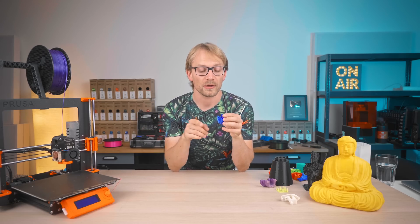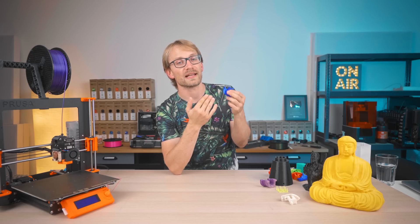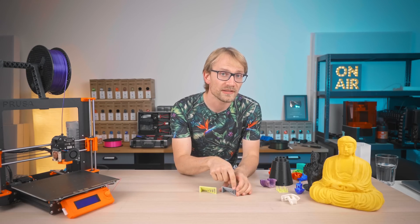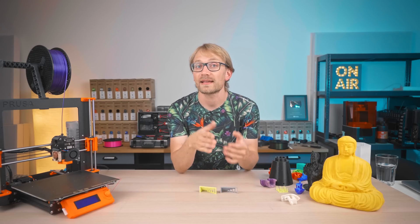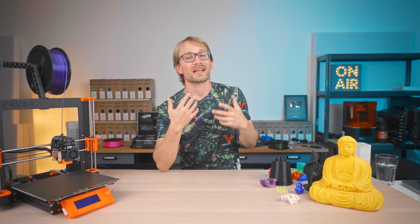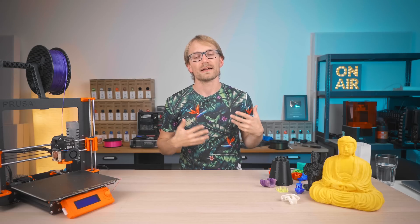Back to curling — that's what you get when your overhang is too steep for your combination of printer, filament, and print settings. It's most obvious at edges where two overhanging areas meet and create a steeper compound overhang. One really cool thing printers can do is bridging, where the printer can stretch a single line of filament over a gap, but for that to work, the start and end points need to be on the exact same height — on the same layer — so the underside of those needs to be perfectly horizontal. We could go into a lot more detail here with design rules, but a lot of it comes down to just actually trying different things and seeing what works. All these rules can be stretched a lot depending on how exactly your models are made and how well your printer prints.